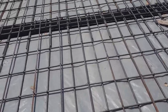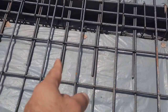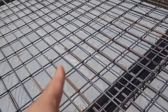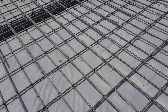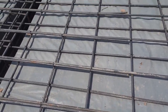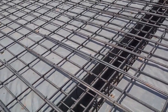Let me show you the other beam. On top of this beam you can also see they provided lapping length — I don't know why they provided lapping length on each beam. The lapping length is about five feet on one side and three to four feet on the other, and two feet here as well. More than 50% lapping length is visible in this construction of the slab — this is a big mistake.